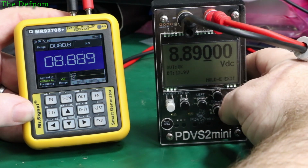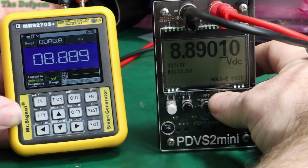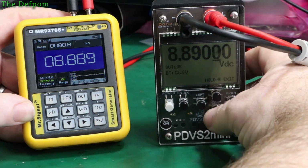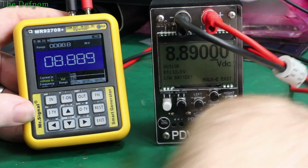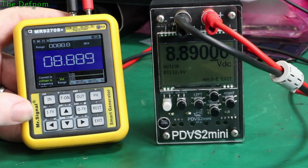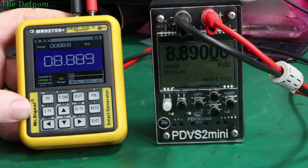Yep. So using this meter I can actually maybe try and see how much it's actually out by. So 100 microvolts, 200 microvolts, 300, 400, 500, 600, 700 microvolts. That's when it tripped over, so it's out by about 700 microvolts. That's not bad really, is it? Maybe it's temperature related as well, maybe being a bit warmer might change things. It's currently 26 degrees in here, according to my benchtop meter here. Gives you an idea, I suppose. That works alright. That's actually pretty accurate, I'm quite surprised.